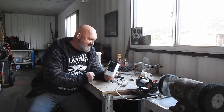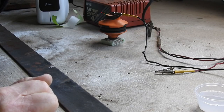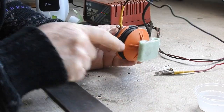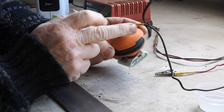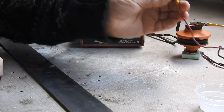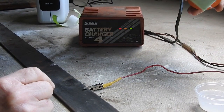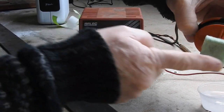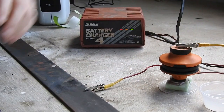Let's come along and see how easy it actually is to get a nice black stenciled touch mark. This is just some 1084 high carbon steel. This is something I made — it's from the end of a drill holder with some felt on it and a rod running all the way through to the negative connection of a battery charger. The positive goes to your item, and salt water — just like that. You don't need a lot; you don't want it running and gooping over everywhere.